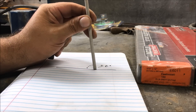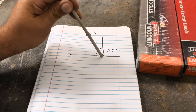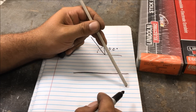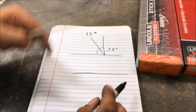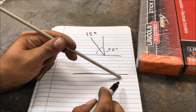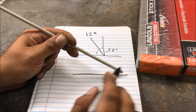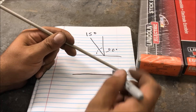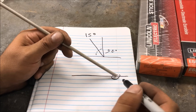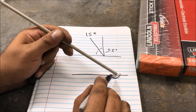This is 90 degrees, so supposedly you want to start off at 15 degrees — just a little tilt — whenever you first start welding. When you start your weld, you're going to strike an arc. A lot of times you just rub it like that and it'll start making electric contact. With an eighth inch rod, as soon as it starts arcing you want to pick it up about an eighth of an inch — that's where you want your arc to be. In the book it says not to stare directly at the sparks; study your little welding pool or puddle.